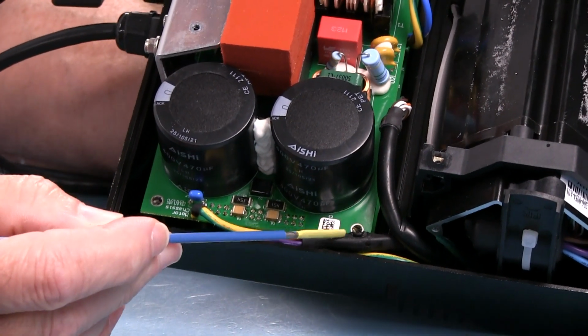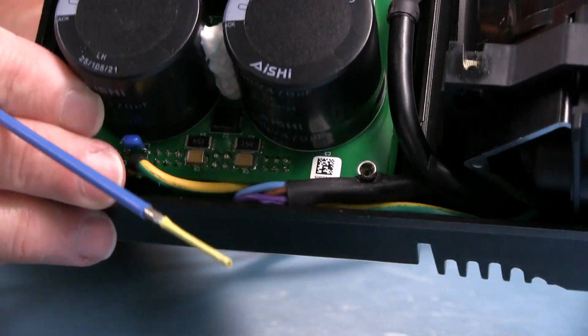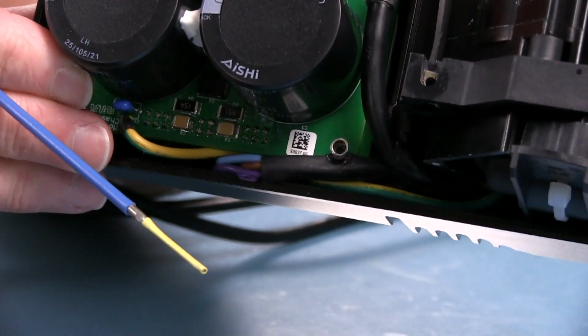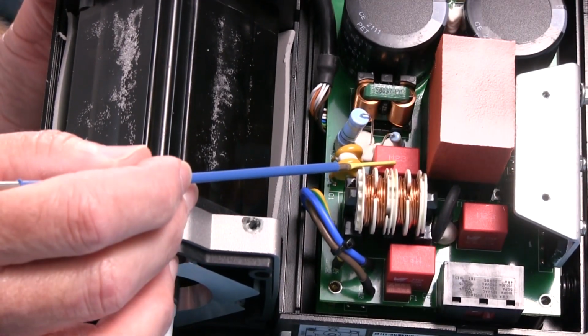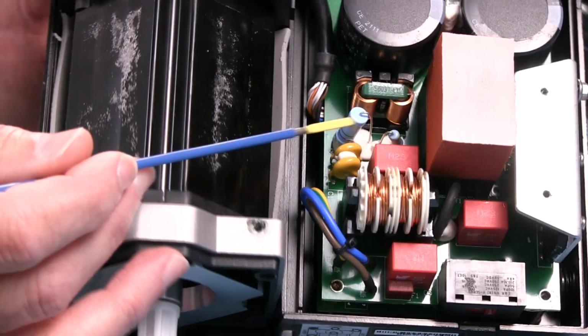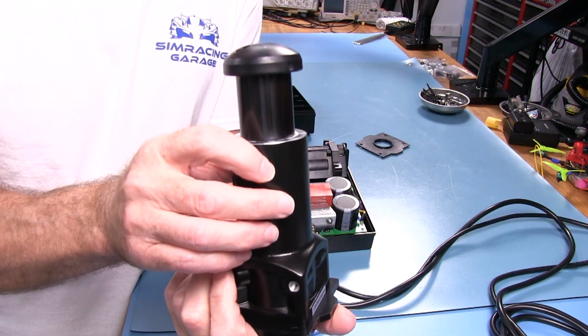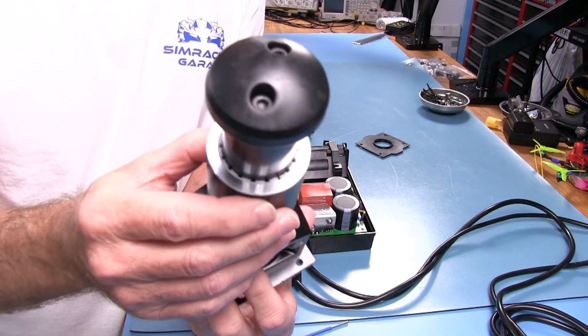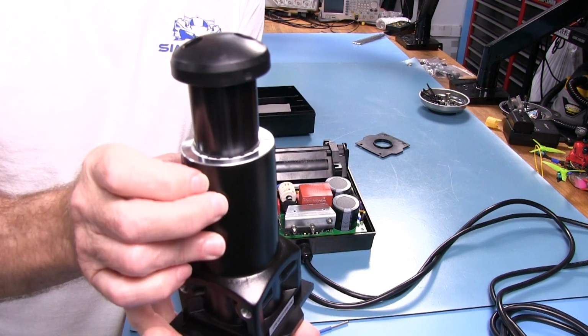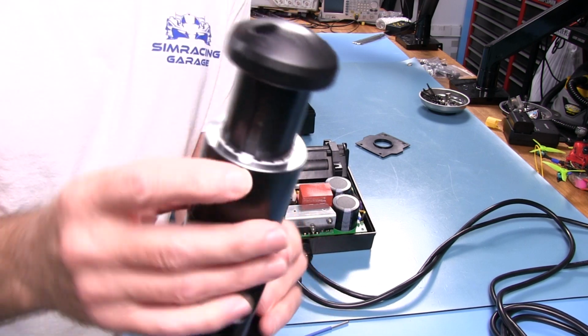In my look inside segment, I did find a pinched cable resulting from the assembly process, which D-Box should be aware of and be working to avoid in the future. The electronic layout was very professional looking and well thought out in design, using good quality components in the circuit board's construction. D-Box uses a corrugated looking sleeve in the actuator housing to guide and lubricate the actuator piston, which should provide a good life cycle, I think.